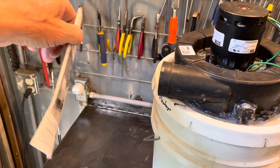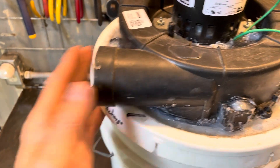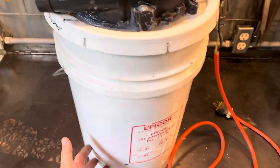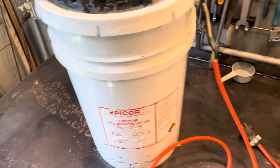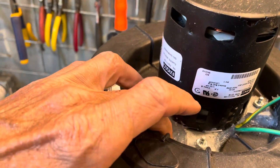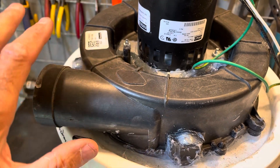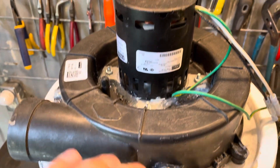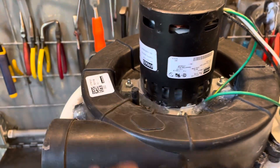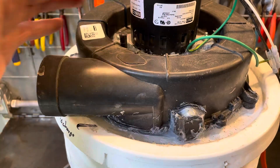There's plenty of flow on the outlet. If you want to throttle the air, you want to throttle on the discharge side — you can throttle it down to almost nothing. If you throttle the suction side too much it'll make noise and won't work right. All the joints are sealed with RTV silicone; you want to seal any connections on the suction side so nothing is sucking in from atmosphere. The only unsealed points are the bearings, and as long as you don't have plugged filters, that should not be an issue.